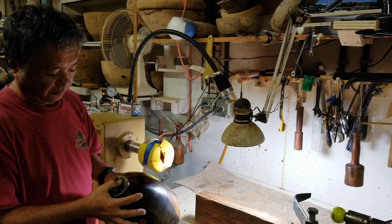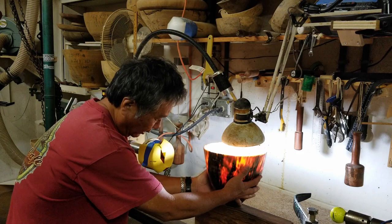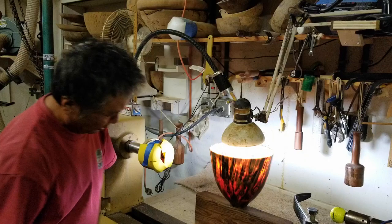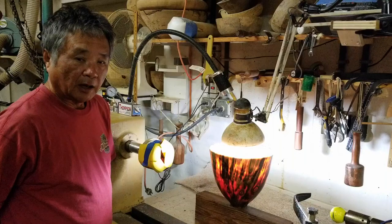So at this point I've completed the bowl, I've turned the foot on the bowl base, and I'm satisfied with the outside and the inside of the bowl. So if I put it under a light like this — a top-directed light — you can see that there is some translucence in the bowl. And this is how I do my Cook Island Pine and Norfolk Island Pine wood bowls.